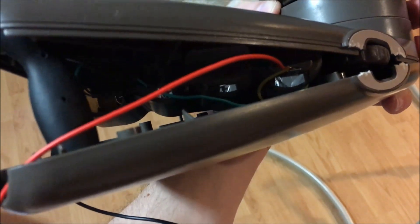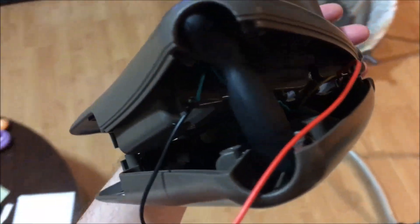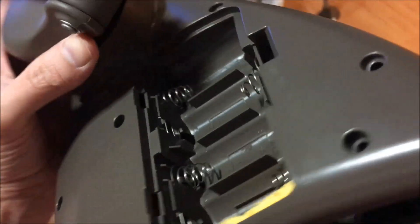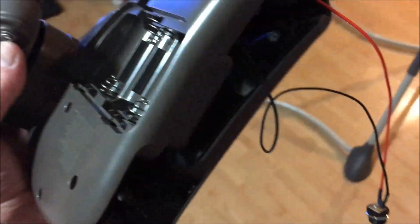You can see that red is going to the positive, which is a yellow wire, and the negative is a green wire. I just soldered those on inside. I had it tested without soldering first — just hooked them in with pressure connections on the positive and negative — and plugged it in last night. It worked through the day, so now I'm actually soldering it and putting it inside.